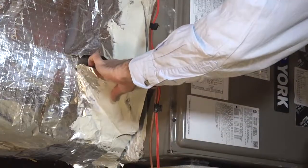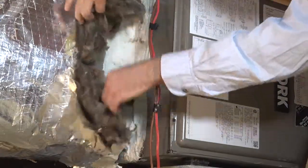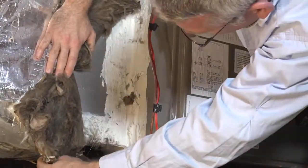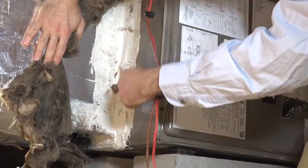After the cut is made, fold the insulation back out of the way. As hard as it may be to check, you will want to pay particular attention to the bottom and back sides of this connection. Quite often, this is not air sealed. You can use a flashlight and a mirror to inspect hard to reach places.